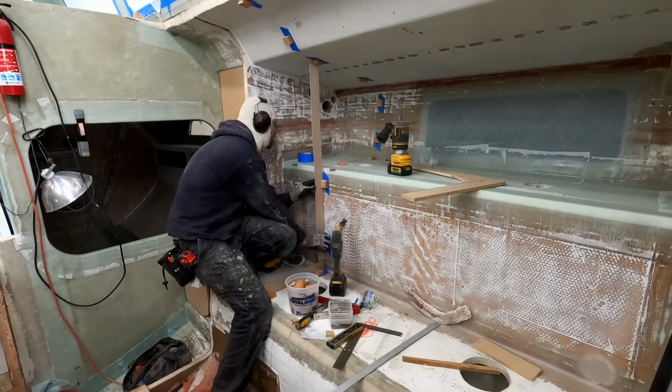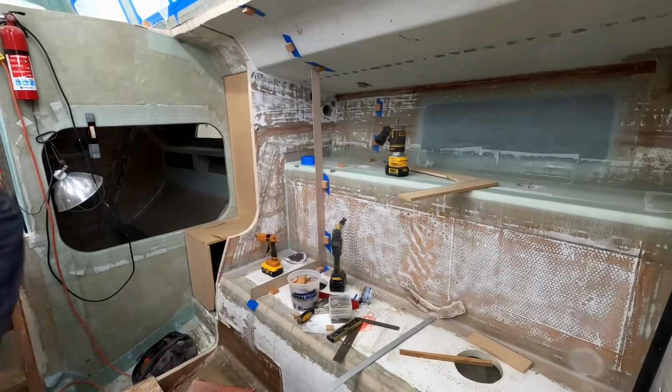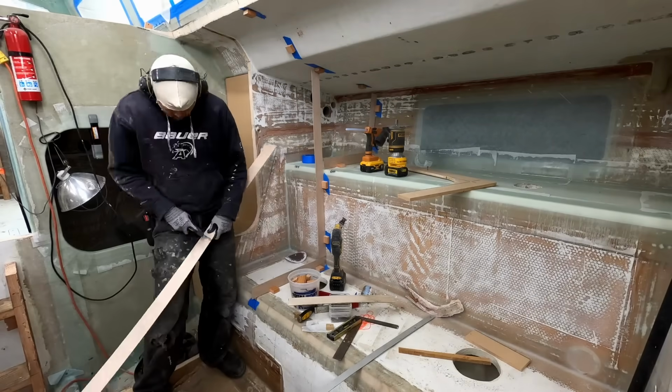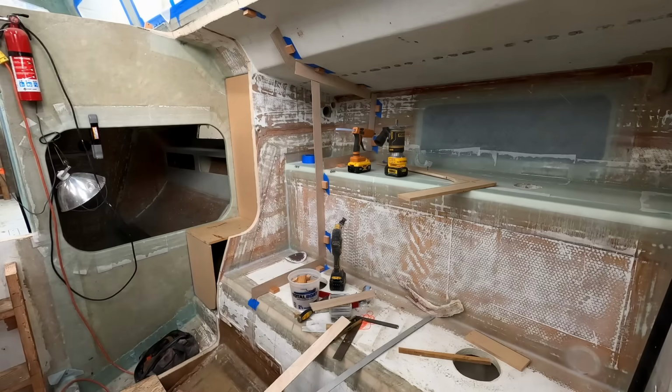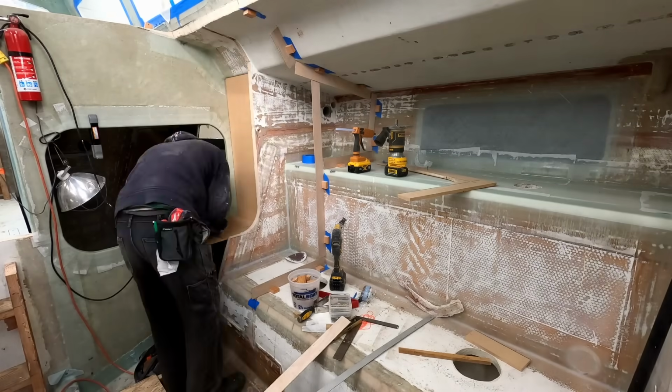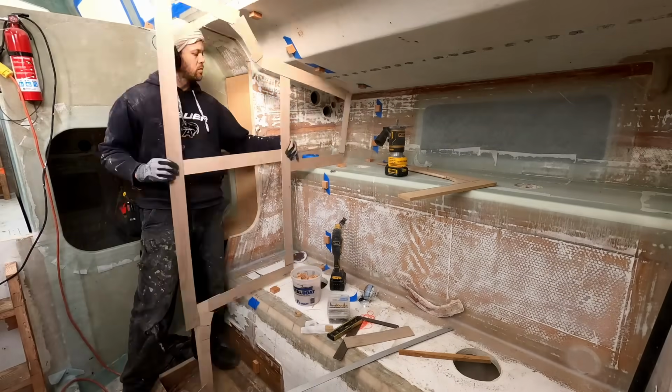I like to go around the perimeter of the area with doorskin pieces that do not overlap each other, so it is perfectly flat on one side. Then I use short pieces to connect the pattern together. This makes tracing a lot better. Once it's all together, I break it from the blocks and take the template to the shop.